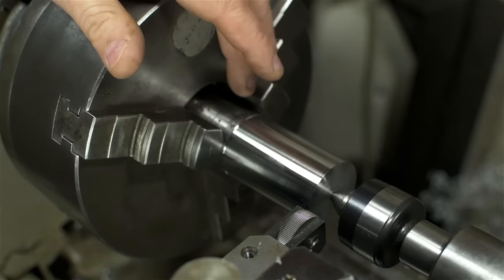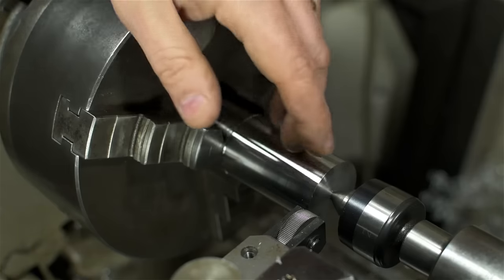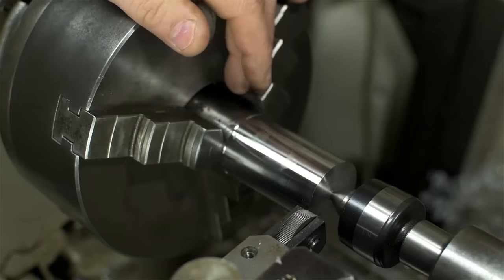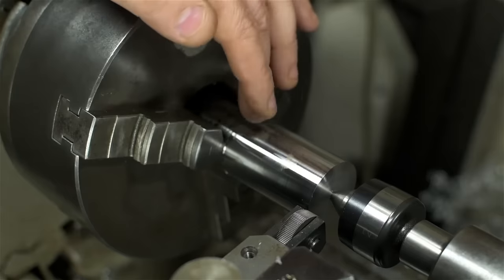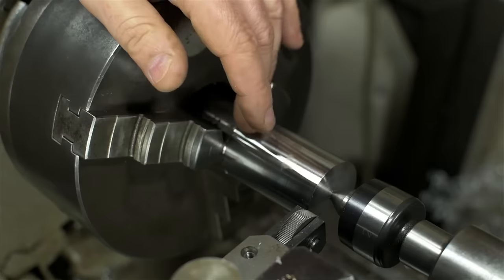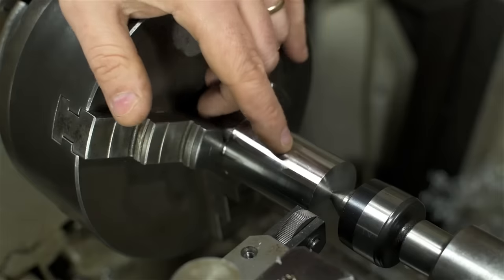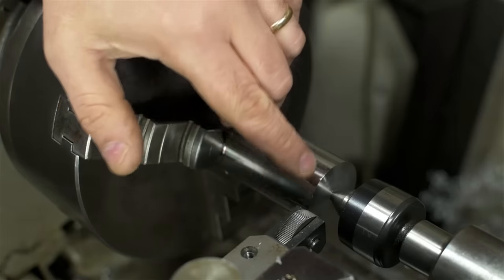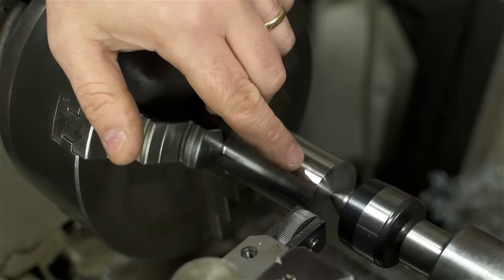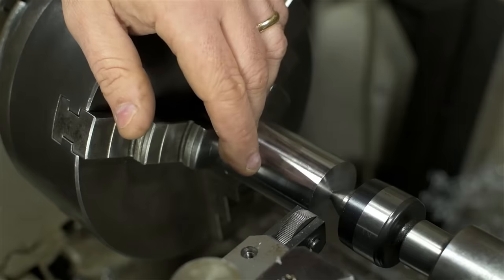On the one four-fingered hand, you'll hear that the diameter, or the circumference technically of the work, needs to be wholly divisible by the pitch of the knurling tool. Meaning if you have a pitch of 2, let's say, to pull a number out of my bum, the circumference of the work should be some whole multiple of that, like 20 or 22 or 24, not 21 and a half or 23 and 3 quarter. The idea behind that is that as you're forming the knurls, they'll sort of mesh like two gears. And if you come around one turn, and you don't have a wholly divisible circumference, then knurls won't line up and they'll start to sort of cut into each other, and it won't turn out right.